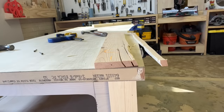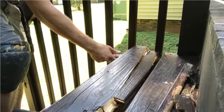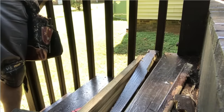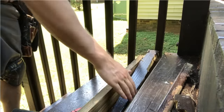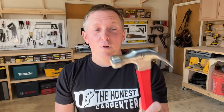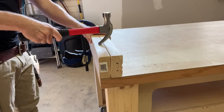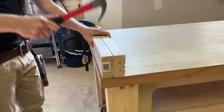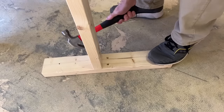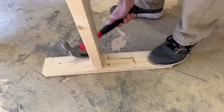And you can even use it like an axe, splitting lumber into pieces with it. Often on job sites, I won't back fasteners out — I'll just split lumber along the grain so it lets the fastener go, then I can pull or break nails at my leisure. The curved claw is terrible for this stuff. The downward-pointing claw gives you very little angle of approach; it's hard to embed the claw while driving forward in a natural motion. And for some tighter crevices, there's no way to get the claw in at all.